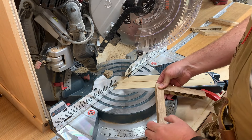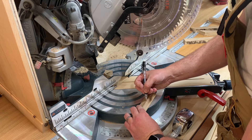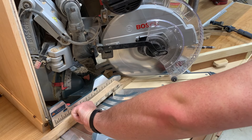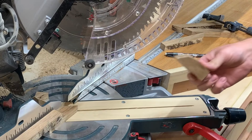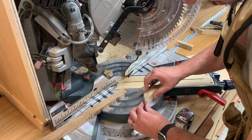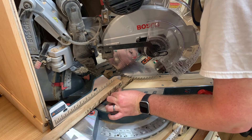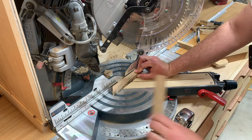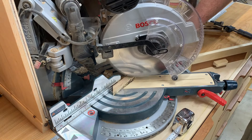You're going to cut these pieces to the same dimensions as your coasters, so the longest part from tip to the other side is going to be the same dimensions — in my case about four and a quarter inches. I clamped this because I knew it was going to be a dangerous cut, and sure enough there was a little scary kickback. Luckily it just chewed up my off cut. Because I already put those 45s on there, you cannot safely clamp the piece that way. I realized putting it on the flat side is much safer and didn't have any issues from there on out.